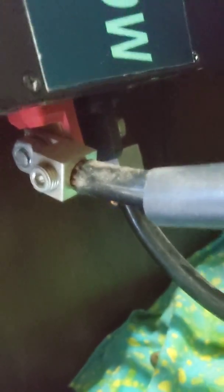But those are the connections from your battery. Those big 2-gauge cables, that's where they go. Because there's a potential of 300 amps that could go through that cable. It won't ever happen because I don't think I could physically do that, but the possibility is there, so why not spend the extra couple bucks to get the big cable?